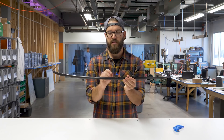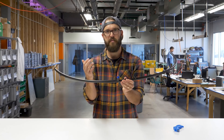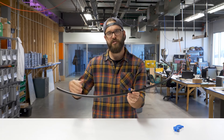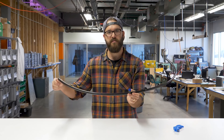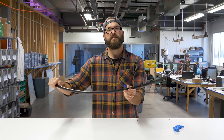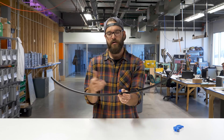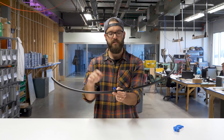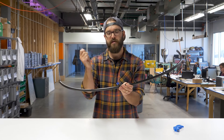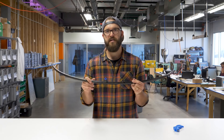With the clog-free style, there's really not much servicing you'll need to do. If one does get clogged beyond repair, a couple of options: if you have extra pressure capabilities in your system — like a valve you can cinch down — you can sometimes increase the water pressure and push things out. If that doesn't work, since these are relatively inexpensive, you can just remove the emitter and pop a new one in place.